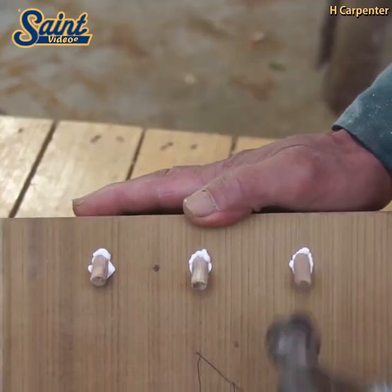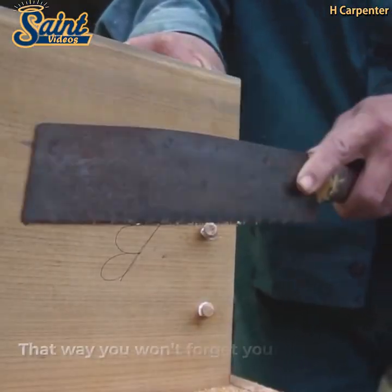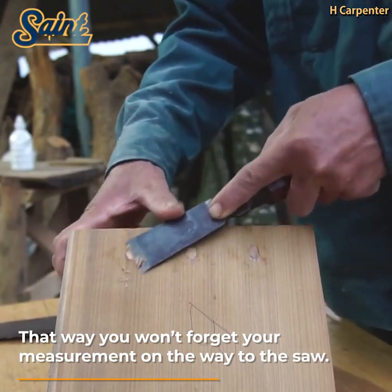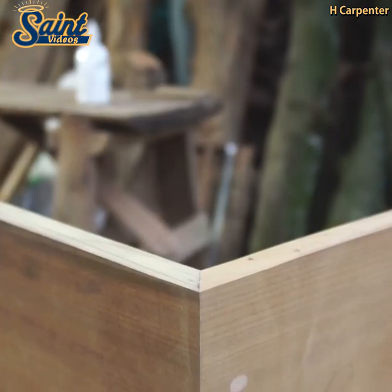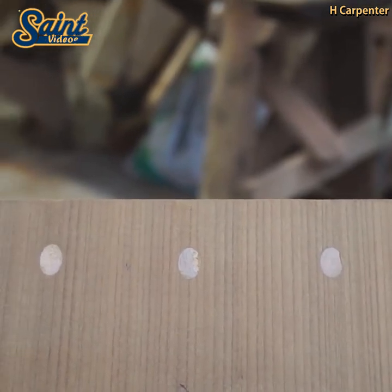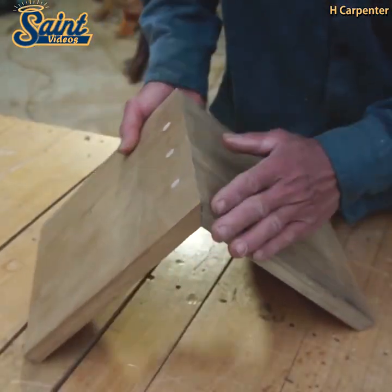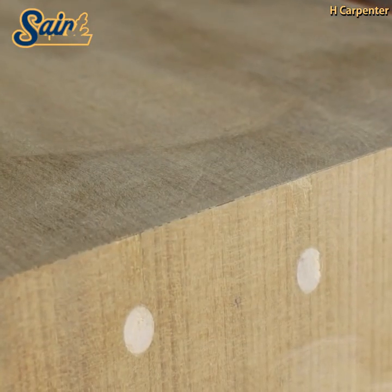Fine-tuning a miter saw for a perfect fit is often a trial and error process — practice on smaller test pieces and work on eliminating imperfections until you get your miter saw set to exactly the right angle, then cut the actual parts. It will look like too much lumber when it arrives, but you will need the extra for corners, blocking, braces, and frames for windows and doors. Set aside any crooked material for short pieces. Thanks for watching.